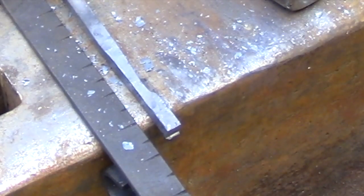I'm demonstrating that here before I take the next heat so you can tell exactly what I'm doing. Here you can see that I'm ready to forge the next offset which creates the hinge area. Because it's facing up it's very easy to tell how much material I'm leaving there.